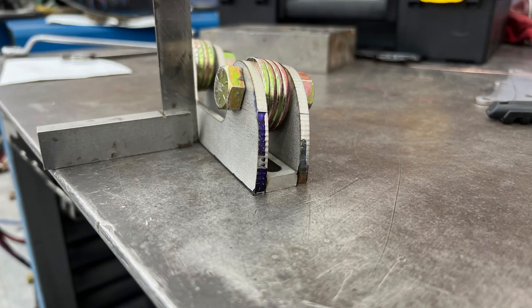This is the result of that whole process — you can see that the assembly leans to one side nine and a half degrees. I also did a little grinding to fit the slotted tab in between so that it is square with the sides of the dog-eared bracket. This all looks pretty good. One thing to point out: the laser-cut parts have a somewhat clean edge but there is a fair amount of texture from the laser cutting process, and the steel has a mill finish with some texture as well — so there's a lot of hand work needed to clean all that up.